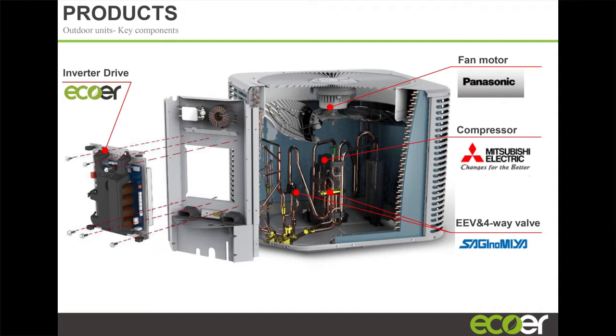We're using a Panasonic variable speed DC outdoor fan motor, which, as I told you, gives us 9 different stages of fan speed. And a Saginomiya EEV. These are all top shelf equipment components. The EEV has 480 different stages, pulses. So in terms of your metering device, you get precise refrigerant metering.